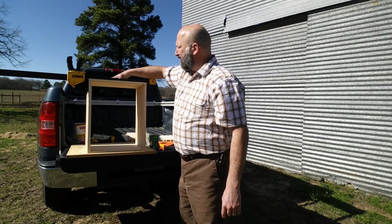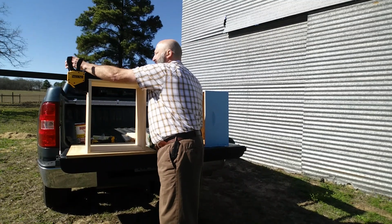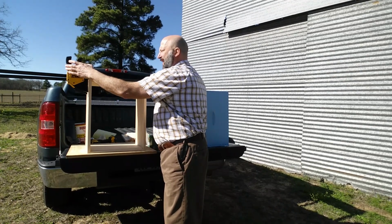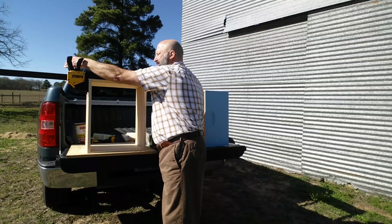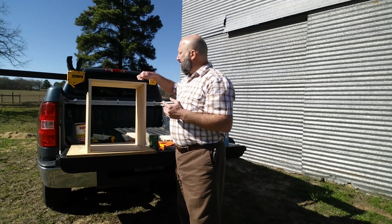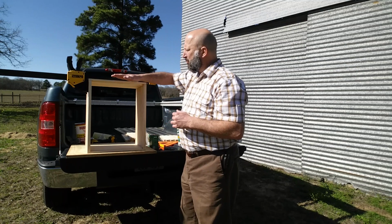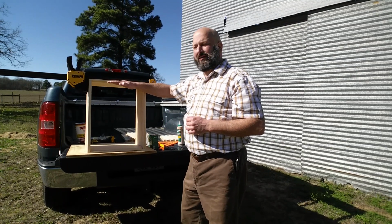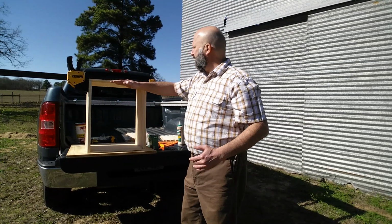I'll put this on, okay? And then I'll draw it back together, and I'll draw it tight, and then I'll back off my clamps, okay? Just want to relieve the pressure, and then I'll put them back on, but they'll just be firm. They won't be super tight. And the reason being is the screws that I put on this side, I start on the top. I want the screws to draw this plate into the grooves of the wood. All right, so it'll be tight this way, then the screws will make it tight this way.